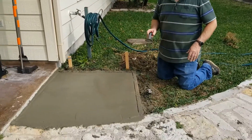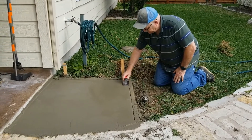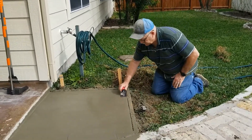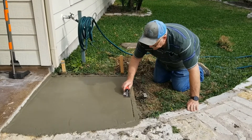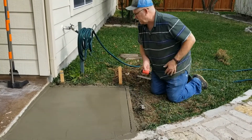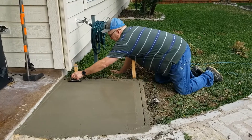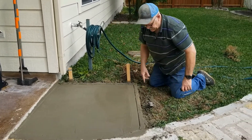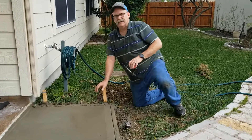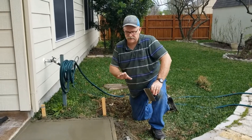This pad is starting to dry some now. I'm going to use this little hand edger. What it does is it separates the concrete from the forms a little bit to make the forms easier to take off when it gets dry. It also, as you run it along here with your hand, it makes a nice straight edge. As you can see, along here it puts a nice clean edge on it, which just gives it a fancier look once you pull the forms off. I'll go over this one more time after it's dried another hour or so just to make sure I've got a good clean cut.